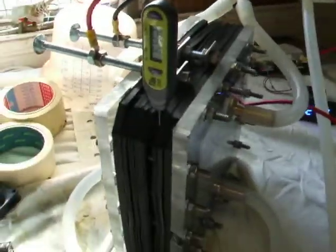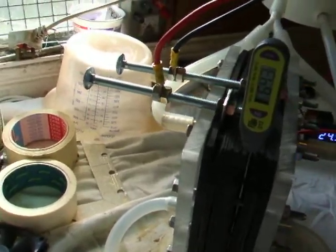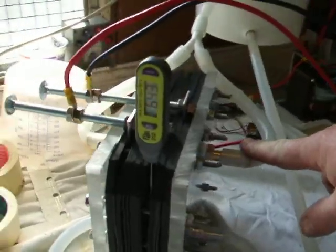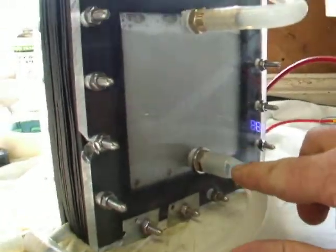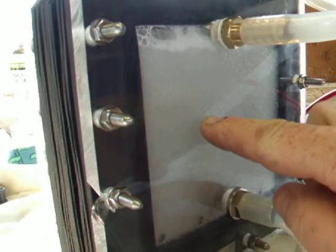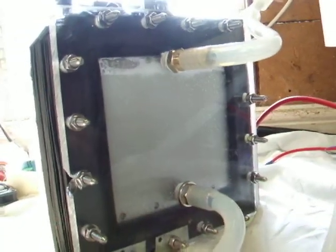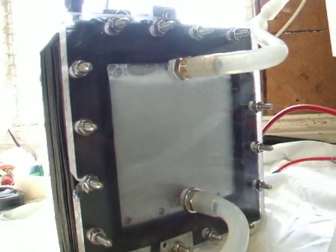The reason I've done that was because on the supply side one pipe wasn't sufficient to let the gas out. I was finding that if it was only supplying this side with no gas out on this side, the gas would actually pressurise it and the liquid level would drop. But putting the balance pipes in seems to have stopped that issue and now it's constantly maintaining a level.